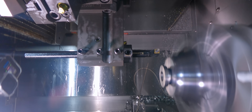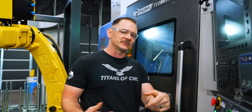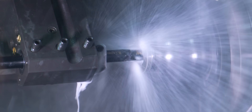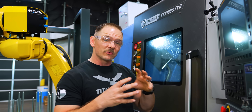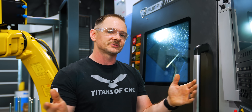The first thing we're going to do on Op 2 is rough out our ID. I went with a little bit smaller nose radius than you might use on a roughing operation — a 1/64" nose radius. I did that because I really want these tools to stay sharp. The sharper they are, the less pressure they'll put on the part, and it's less likely to move the part around. Remember, we had that really tight tolerance, so I really want that part to stay secure in those jaws — hence sharp tools.